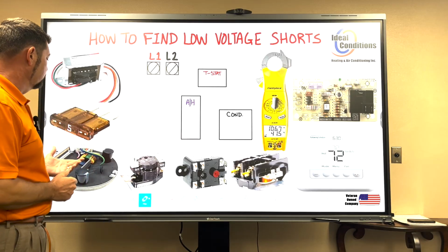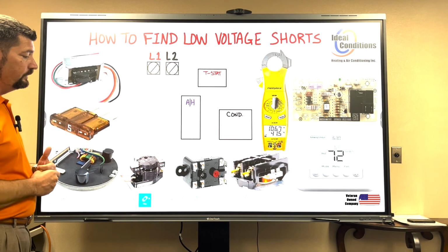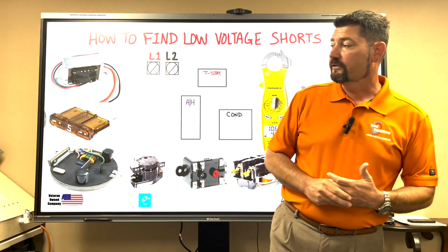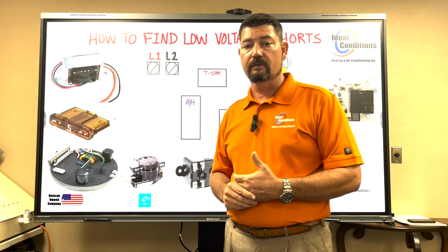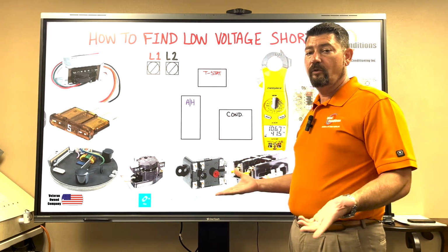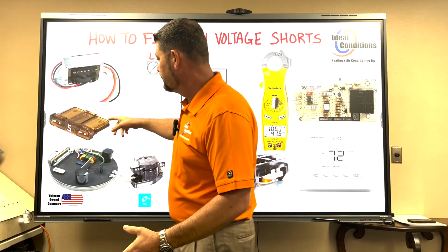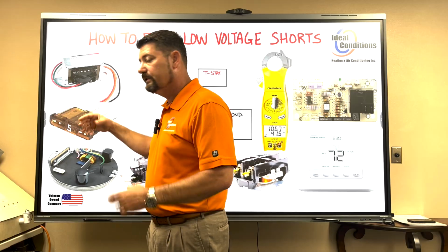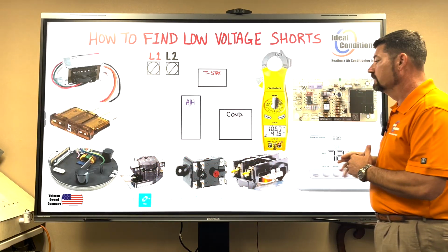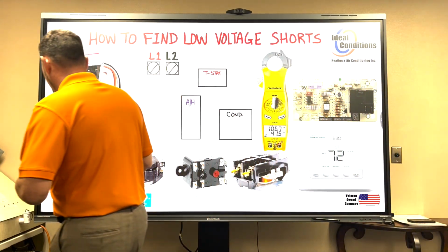If you're a homeowner or very inexperienced and you're replacing your own fuse, you may make the mistake of running out of the number 5 and grabbing a 7.5 or a 10 or something higher than that, because your auto parts store sold a bunch of different sizes and you're thinking, well, it looks the same, has a different number, but it plugs in just fine. You know, maybe it's being plugged in here, right? And so, let me go ahead and highlight that again.